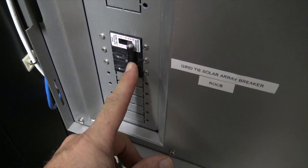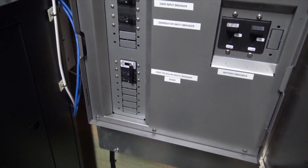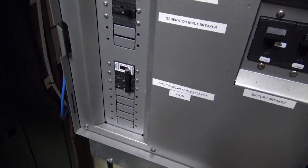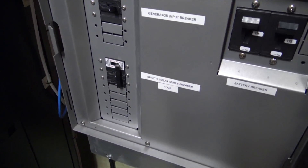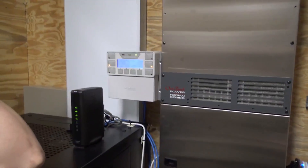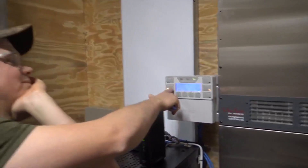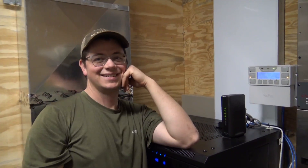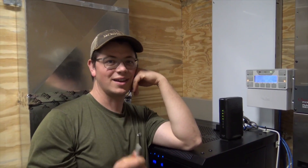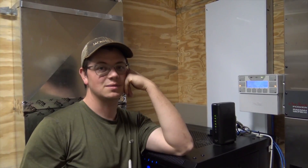Johnny said we're doing mad scientist stuff. This is the ROCB breaker — when the battery voltage hits a certain level, it turns the grid-tie inverter off. It's Outback's seamless AC-coupled solution. We're doing the final commissioning of this job today — we've done the generator testing and explained everything to the customer. It's been a doozy, says Johnny Valentine. AC coupling is best as a retrofit for an existing grid-tie system, but if you want something that is efficient when the grid is up and will also work when the power is out, you can AC couple a system.